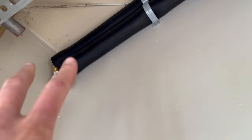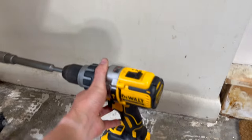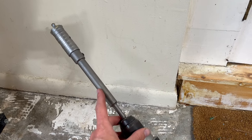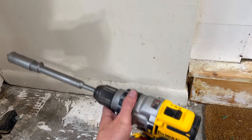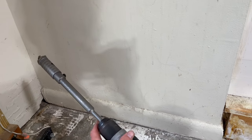Hot and cold supply lines — I just installed elbows on the end. I'll tie into those with three-quarter inch PEX, run down this wall insulated, and drill two holes to go into the kitchen. I'm going in right here — two holes for half-inch PEX this time. I've got my drill set up with a concrete hole saw. I got this bit on Amazon — it's actually for an SDS hammer drill, so it doesn't fit perfectly in a normal drill chuck, but if you get it just right it will work. It's a long bit that will go through block walls, which is what's behind this drywall.